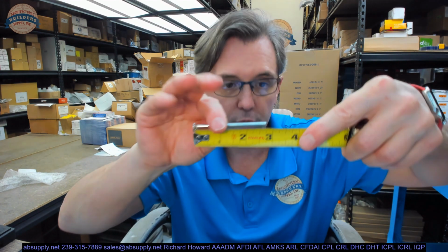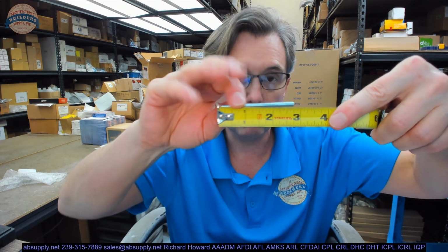And then you have, if these are 3-inch, then this would be for 2 1/4. Okay, 2 3/4. So, okay, I'm going to say the short one, the 2 1/4, is probably for 1 3/4. The next longest one, 2 1/2, I'd say that's probably going to be for a 2-inch thick door. And then, of course, you've got the 2 3/4, which would be likely for 2 1/4-inch thick doors. So the one that seems odd to me is the one that's for a 2-inch thick door.